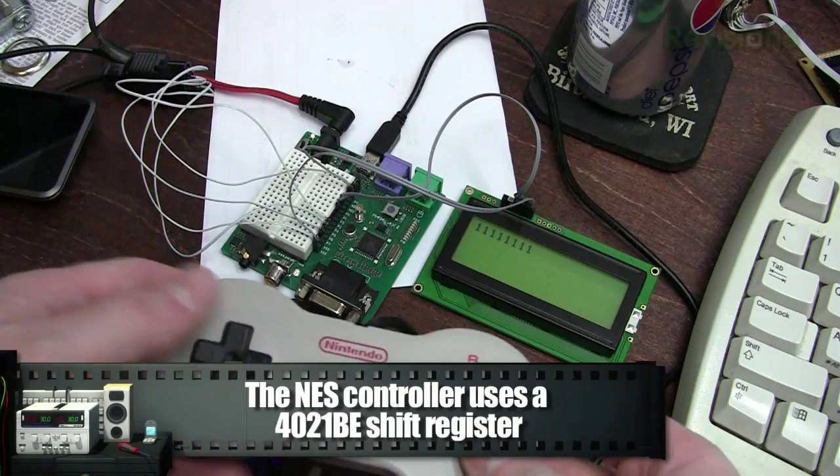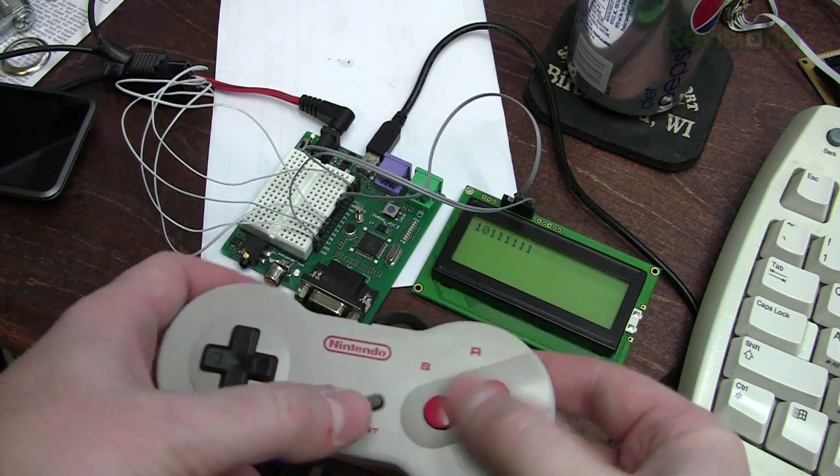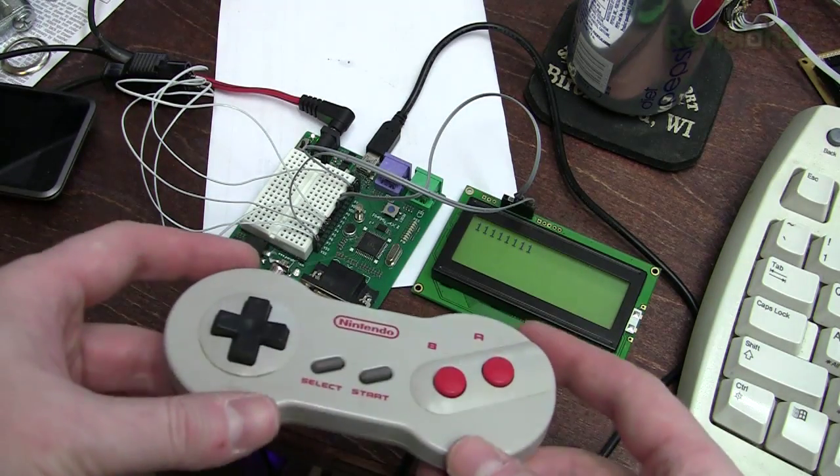Let's take a look at this in practice with the NES controller. We've got our Nintendo controller and it's shifting its bits — up, down, left, right, select, start, B, A. The controller basically fits into one byte of data, and that's how the Nintendo reads it. Now, it might not seem that useful to only read eight bits from a shift register, but you can put them in series — as you shift out the bits from one shift register, it shifts them into the next, kind of like a centipede. So you could have four shift registers in a row and get 32 bits out the end. You can daisy-chain as many together as you want; it just depends on the speed of accessing it with your program. With a high-speed processor you can daisy-chain quite a few together and still get the data out quickly, giving yourself many more inputs than you have on your processor itself, or outputs as well.